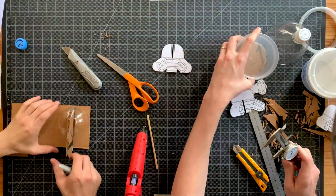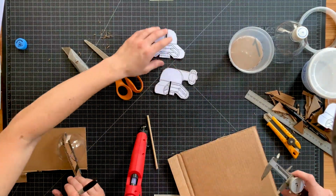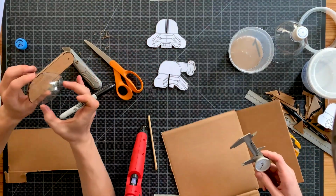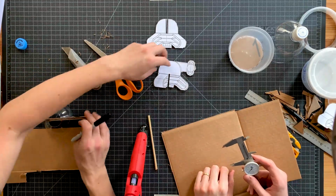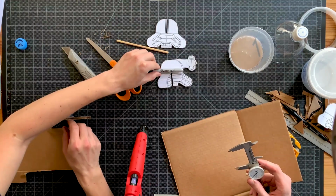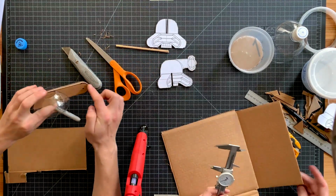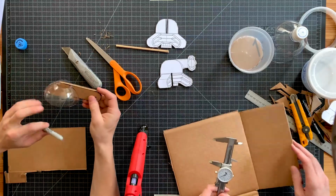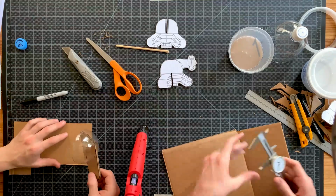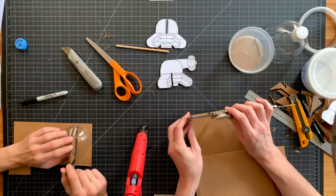Got it. In the same way, if you're going quick and loose, like I haven't measured anything, I started using the top of the bottle to set the scale for the rest of the part. Then I was just visually saying, even with a stick or a pen, okay, the diameter is this, the tail is maybe two thirds of that. And then using that to sketch out how far, and if this is too far, I can always tweak it. Getting used to those kinds of proportional measurements is probably even more critical than trying to get into millimeters and tenths of an inch.